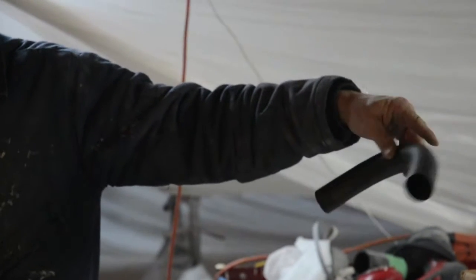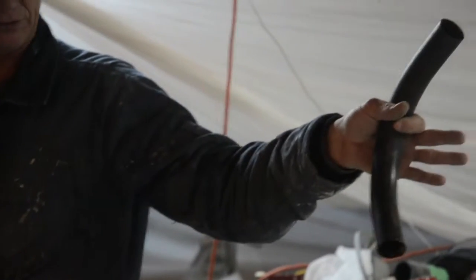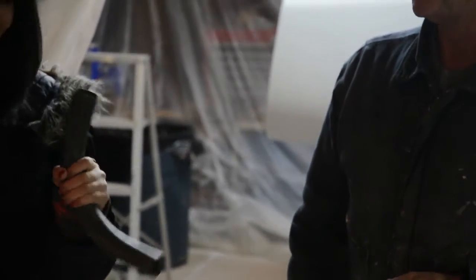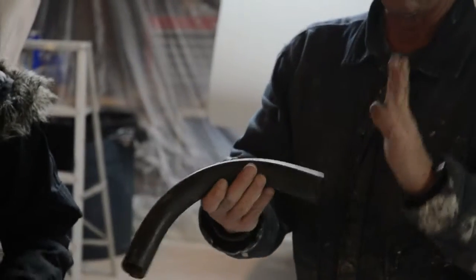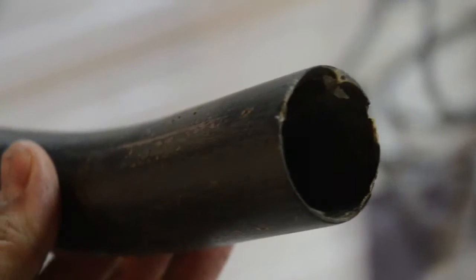We did a lot of overnight racing years ago, so we had a lot of pipe berths down below, and the stainless steel tubes were pretty heavy. So we made these carbon tubes, and this is just one wrap of carbon. And that's just fiber orientation. Yeah. Bag added weight that we didn't want. Wow. That's how stupid it was. Jeez. Yeah. It was a tenth of the weight of the stainless and 20 times stronger. Ridiculously strong.